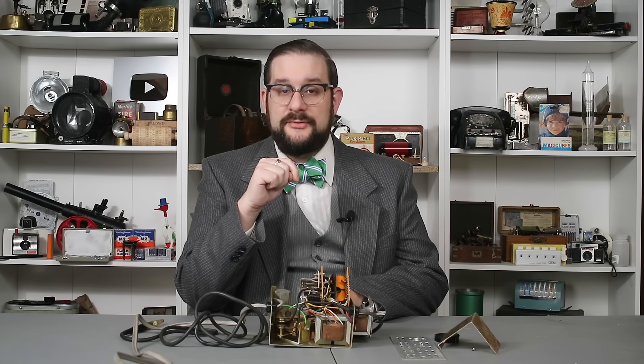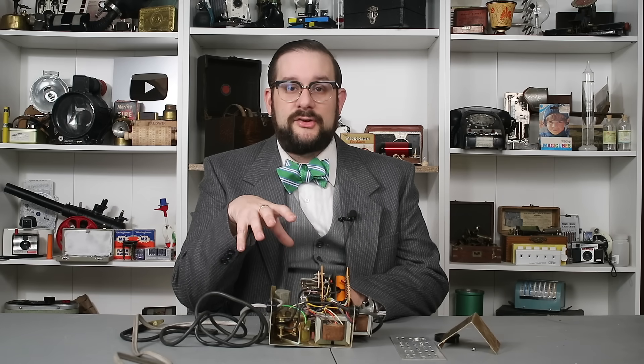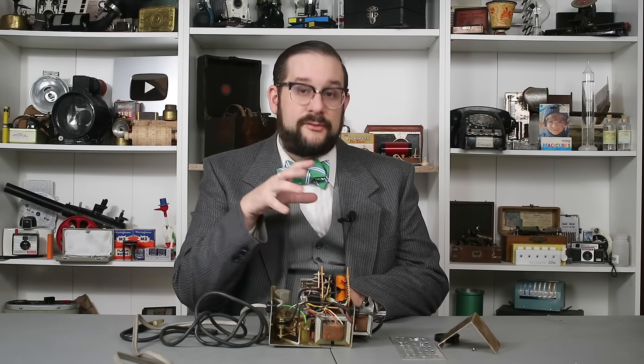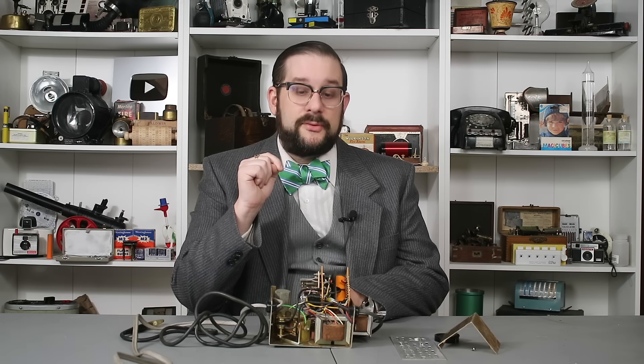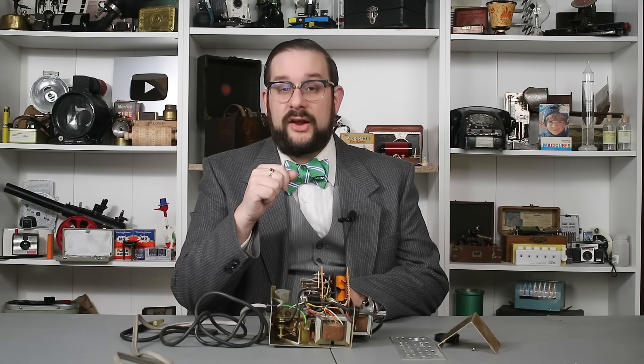There are two important things worth pointing out. First, this type of sensor is not appropriate for use in flammable atmospheres, because introducing a flammable gas to a detection element heated to 1000 degrees Celsius is a very bad idea — though there are versions using sensitizers such as sodium hydroxide that operate at much lower temperatures and are appropriate for flammable atmospheres. Second, the sensitivity of this detector decreases over time because the alkali metal atoms in the sensitizing source become depleted, meaning you need to increase the amplifier sensitivity over the detector's lifetime and eventually replace the detection element itself.